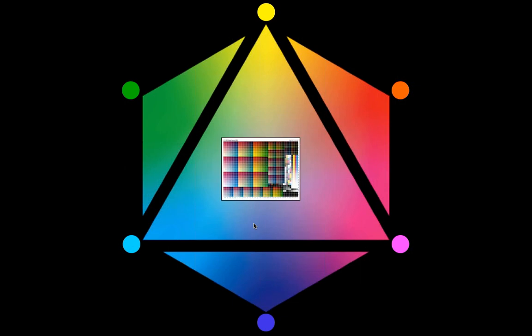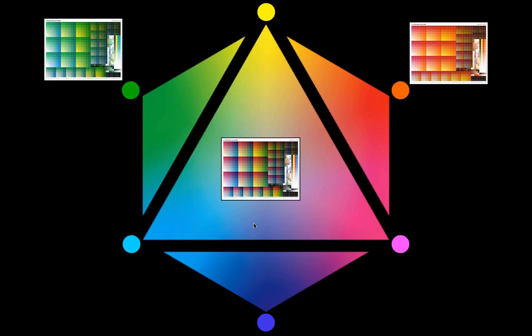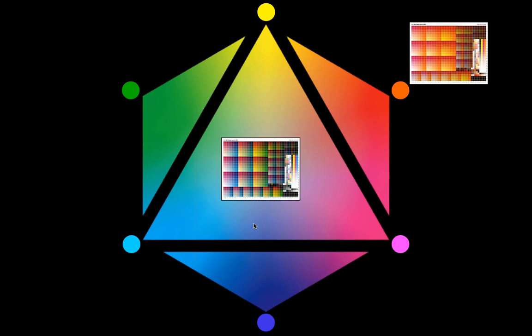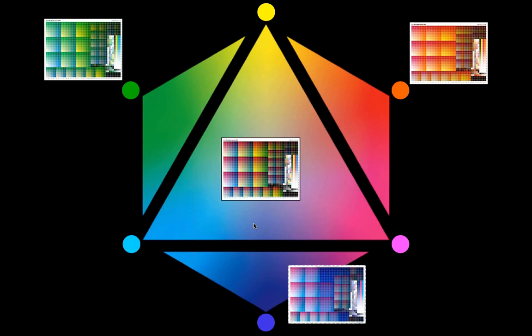The theory we kind of use is we do a CMYK profile, then we have the same data set, but the cyan plate is in the orange deck. Take that exact same data set, but the magenta plate is in the green deck. So we have all the combinations of magenta, orange, yellow, and black. Using a copy of the magenta plate in the green deck, we have every combination of yellow, green, cyan, and black. And using a copy of the yellow plate in the violet deck, or blue deck, we have every combination of cyan, violet, magenta, and black.